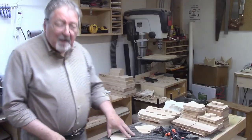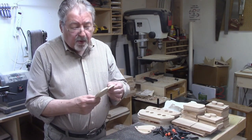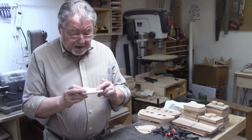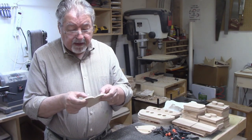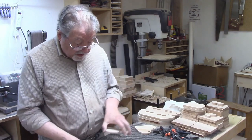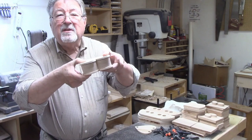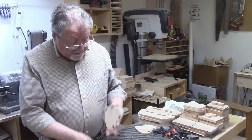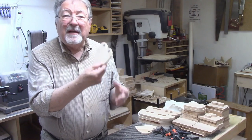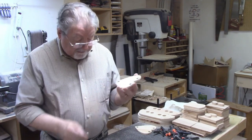That's going to be cool. Well, this is a good idea, I think, the magnets, but this quarter inch thick top, I drilled these as deep as I could go, and I thought they were going to be flush with the top, and the magnets weren't, and so it wasn't a very good fit here. There's a gap there. So I tried sanding them down, and these are ceramic magnets, and they kind of broke up and still didn't have them flat.